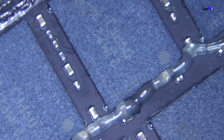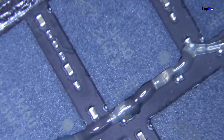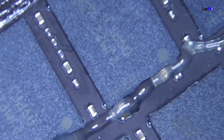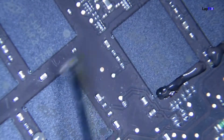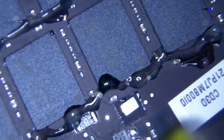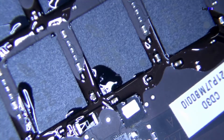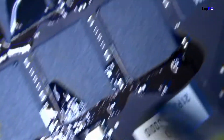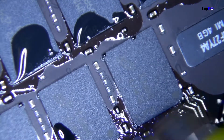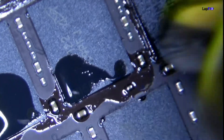For the reflow, the key is really not to put a lot of flux on each one. There are about 16 of them in two rows, so we'll just put a line of flux along the bottom of each row. That will be enough to go underneath the components — it'll push in and ensure a nice reflow. If you put too much flux it gets stuck underneath, and you don't want a gunky mix of flux and liquid spill residue under there.